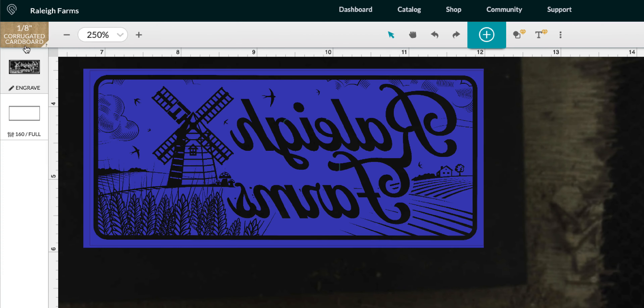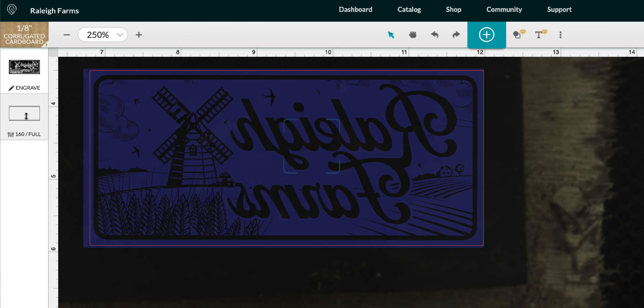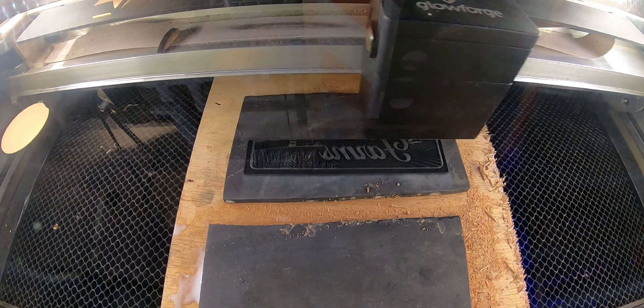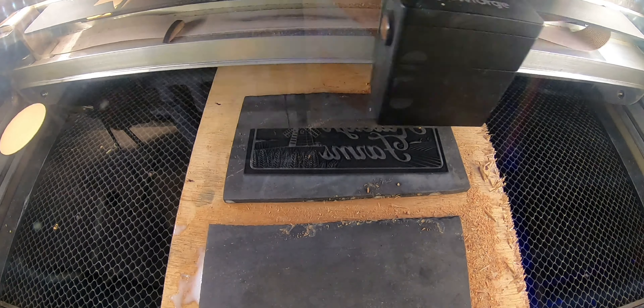My cut line I have set pretty high in order to cut through this flooring material. The key is you want to have your foam glued to the material you're going to use for your stamp. That's pretty much it for this tutorial. Your key is your settings for etching, finding the right material — PVC-free. Make sure you don't laser cut PVC and that you have proper ventilation.